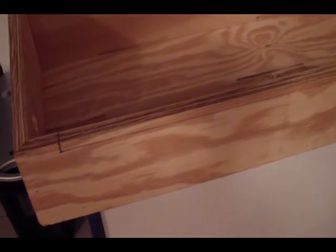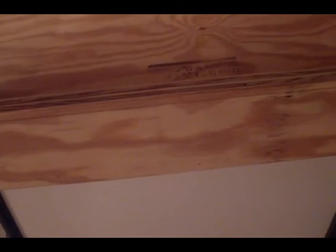And we're going to try to cut this on the table saw. I would use my trim router bit and just put a piece of wood on the inside to guide it temporarily. But the trim router bit only goes probably about 1/2 inch. It can't make it through this material. This is almost 3/4. So we're going to do our best to put the entire box on the table saw and just run it against the guide on the back of the box.